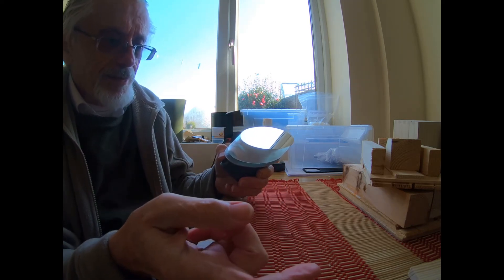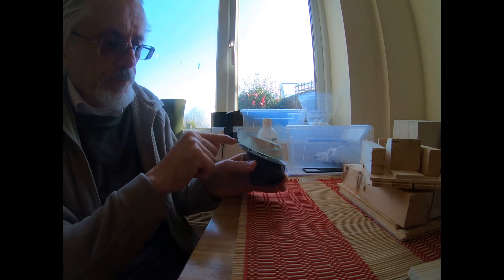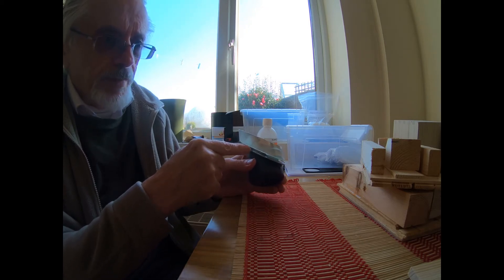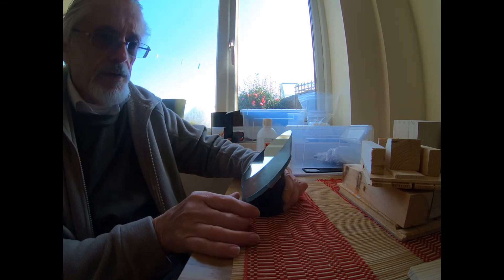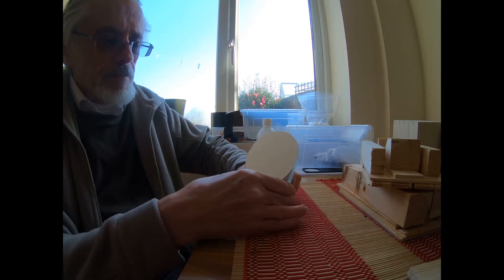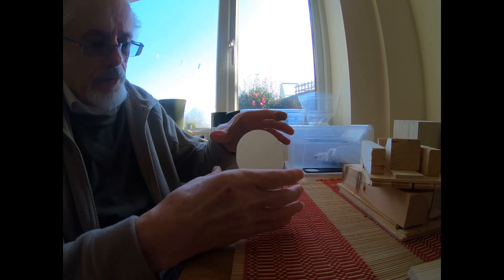Adjusting that when it's in the telescope tube is really quite difficult. With many systems, if you don't glue the mirror to the metal plate and calculate exactly where you want the offset to be, once you screw it in and tighten up the nuts and bolts and screws, that's it — you can't move it. But the reason for inventing this system is that I can rotate this in any direction, if needs be. Gluing things is quite tricky because you position something, glue it, and there's no guarantee it won't be a few degrees off.